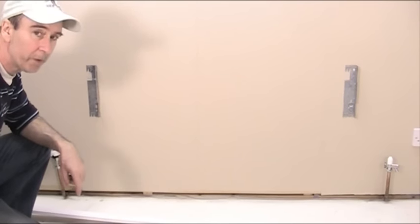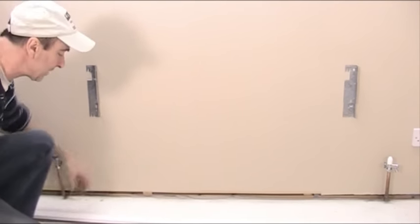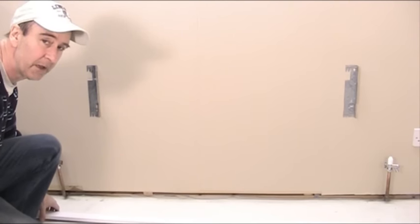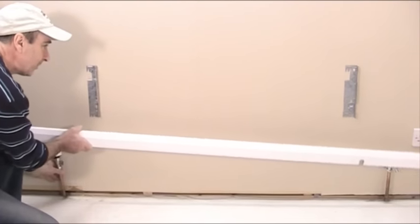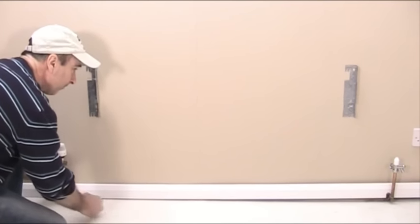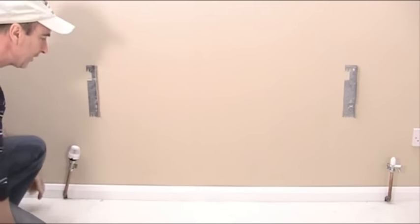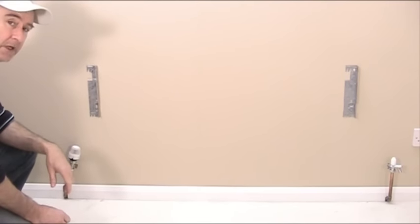The radiator has been taken out of the way and we've removed the two old pieces of skirting board. I've cut and prepared this new piece — it's now one continuous length — and I'll show you how easy it is to slot it behind the radiator pipe without fitting it in two halves. Simply slot it over this pipe and over this one, line it up and drop it in. See — it's a nice long length and looks a lot neater. All I'm going to do now is fix that to the wall and then we're ready to put the radiator back on.